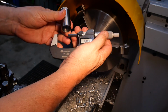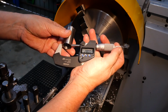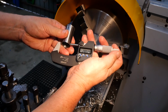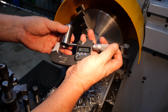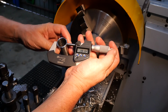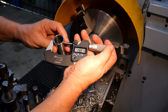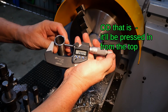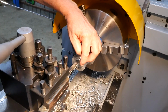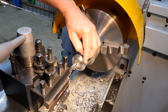So I think it's time to do a proper check on the cylinder that we want to use on the liner, and we've got 28.002 on the bottom there. I think that's grown a little bit while I've been holding it. It was 27.999, anyway 28. I deliberately made it so it was slightly bigger at the top than the bottom. Yeah, 28.005. Okay, so I just ran through at 26.5 and mic'd it, and it came out spot on. So I'm getting some confidence now.